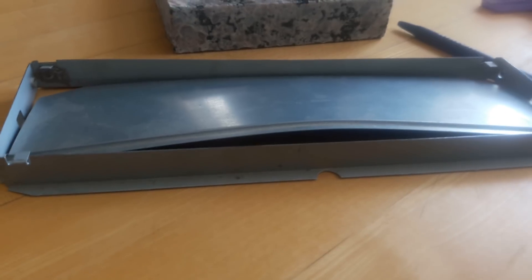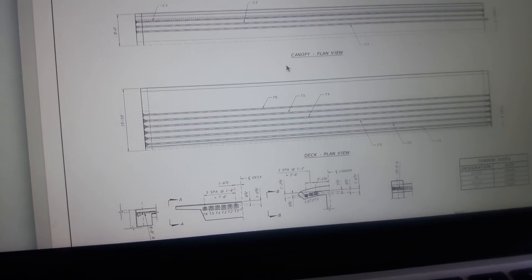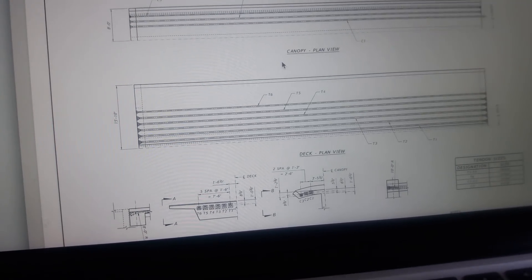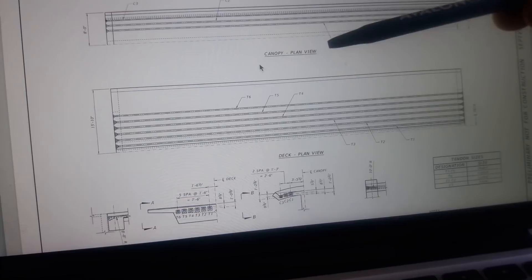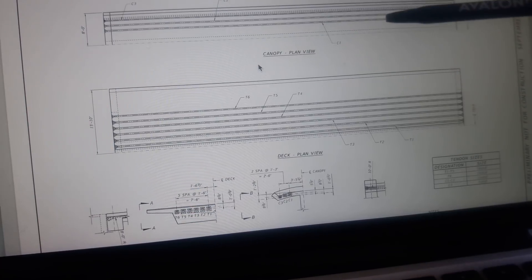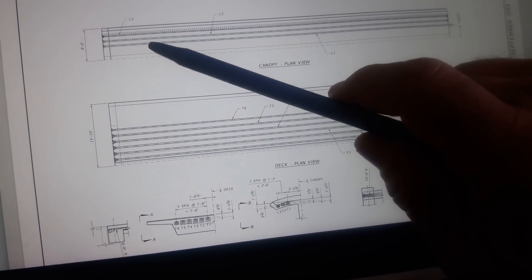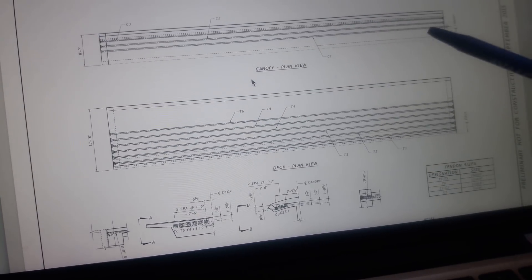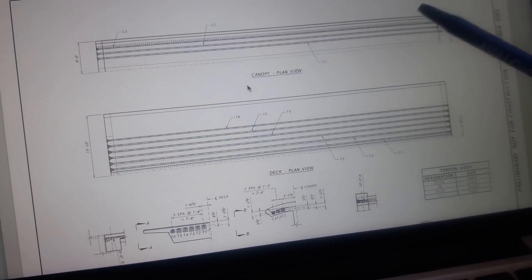This bridge's canopy plan is eight feet wide — that's half the canopy — and then there's where the node goes down the middle, which would be the different blisters. That's where the post-tensioning cables went through. Member number 11 should not have had post-tensioning at all as per their plans.